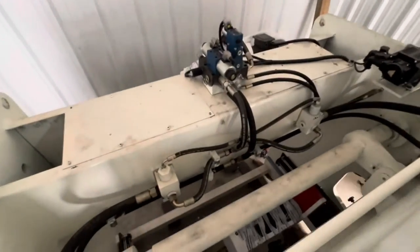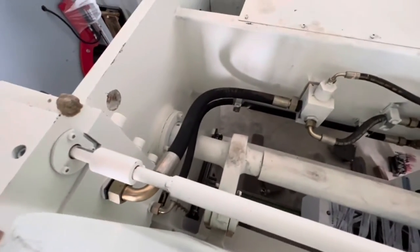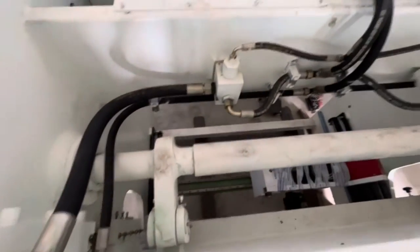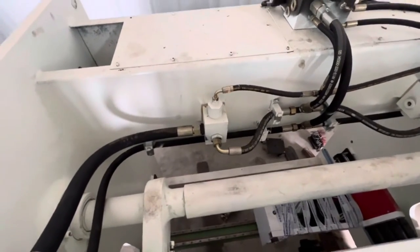Let me show you how this is designed. That's your main control right there, and you see this rod running across right here connecting to the other cylinder. And then you've got this huge torsion bar — which these machines do not have — and that torsion bar attempts to keep both of the cylinders in sync.